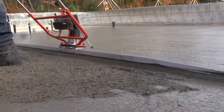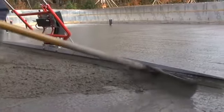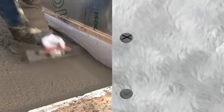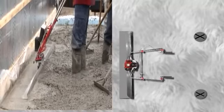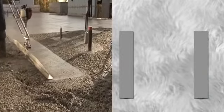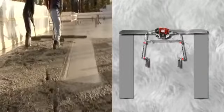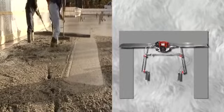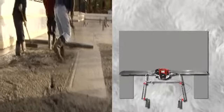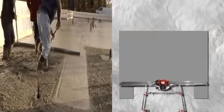The Magic Screed and the E-Screed require the same conventional method as hand screeding. Place the concrete. Depending on the size of blades used, prepare four leveling points at the needed distance. Screed approximately 12 to 16 inches wide on both sides following the leveling points, creating an unscreeded surface between wet pads. Then with the raker following behind you, making sure that you have the necessary amount of concrete on the back of the blade to create a rolling effect, screed the concrete keeping the blade as flat as possible while using the cutting edge.